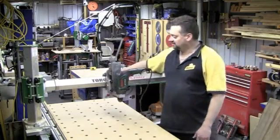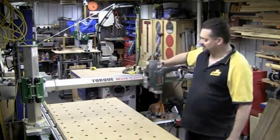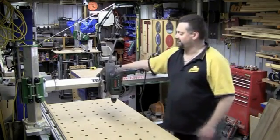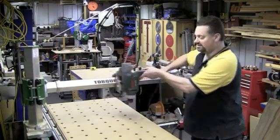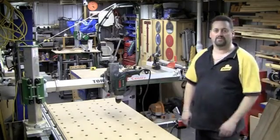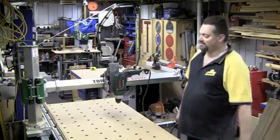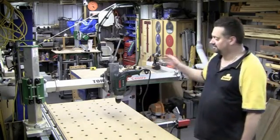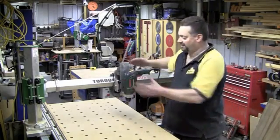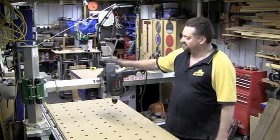The second is the Y axis, and the carriage can actually travel up and down the beam. You can unlock both the X and the Y and have them both moving together if you needed to. Quite often when you're doing a surfacing operation, that's a common thing to do. But I find I like having the ability to lock one axis and just use the other one for the majority of movements — move the tool along the Y axis, lock that off, and then do the X axis passes again. So that's X and Y.